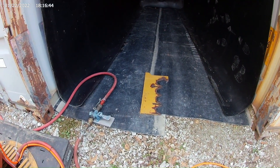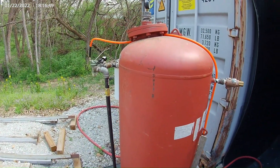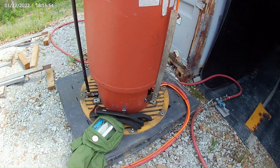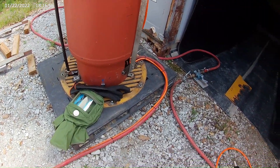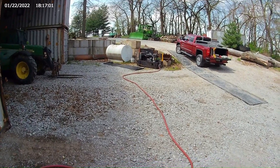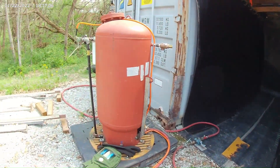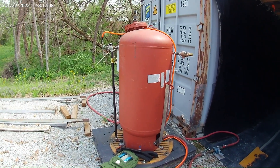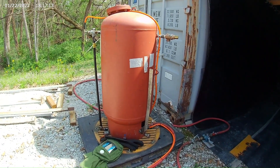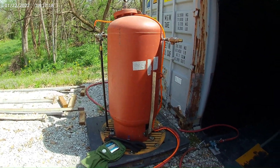This is a 3/8-inch thick piece of metal here — it's got paint on it. We're going to sandblast that off. We just put a 50-pound bag of black beauty sand in it. A new pair of rubber gloves and a helmet, and I've got on a real heavy coat. We've got our compressor sitting over there with the regulator set at 90 pounds. We've already pressure tested this thing to 150. We're probably going to run 70, 80, maybe 90 — not much more than that.